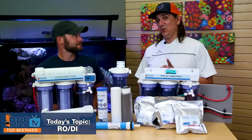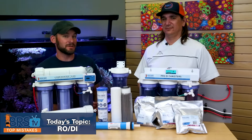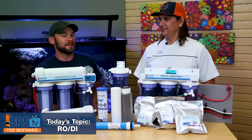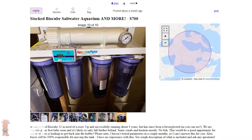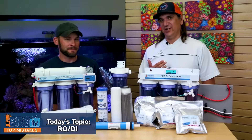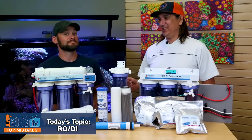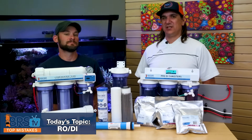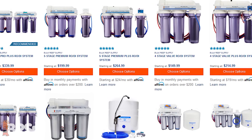Number 17 — something I considered with my first system but ultimately avoided. The mistake is buying a used RODI system. Your first instinct is to just change all the filters, but it goes beyond that. A used system has almost always been sitting in someone's garage for years, so all the filters need changing, and on top of that, most of the seals are dried up and need lubrication. When you do the math on the cost of all those filters plus the seal work, in most cases it's better to just buy a brand new system.